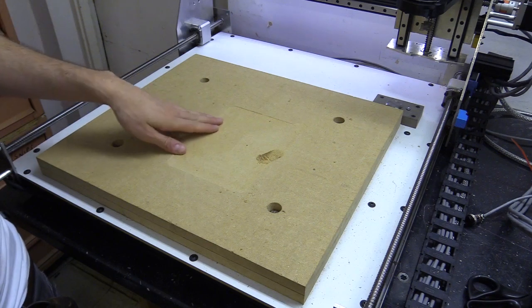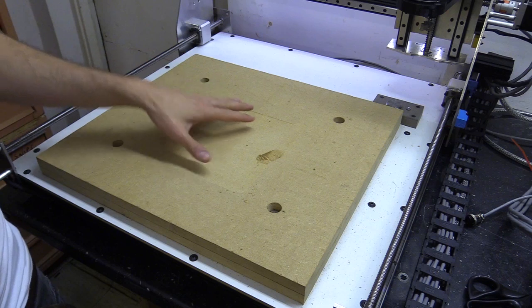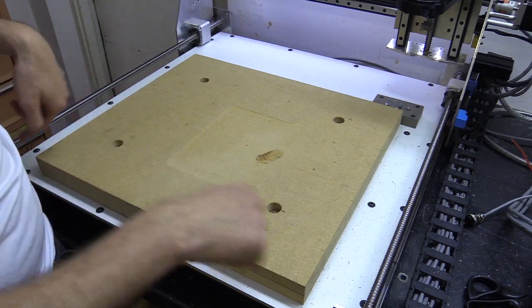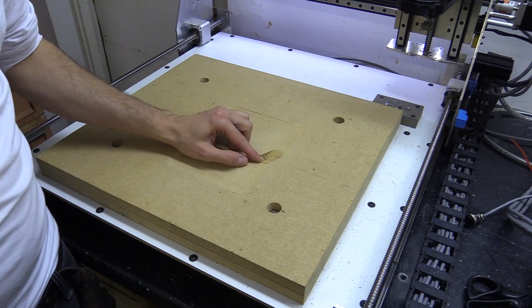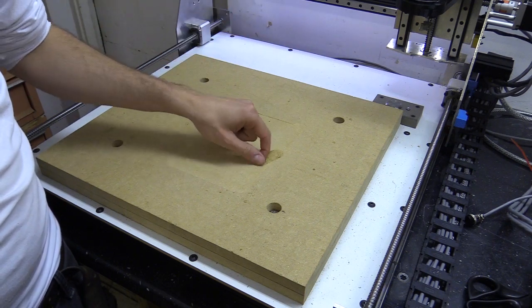So I just had a major boo-boo, and it happened in a bit of an unusual way. As I was doing my surface toolpath, I realised that I'd actually orientated the board the wrong way around in the software. So I went to stop the job by pressing the abort button in my software, and the machine just plunged straight into the wasteboard.